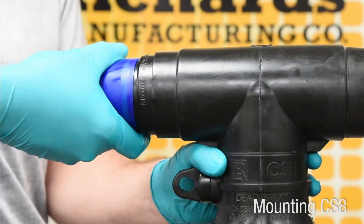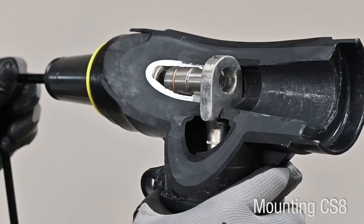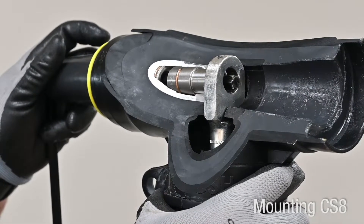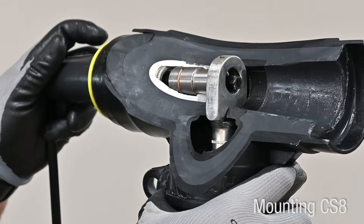The H fastener is through broached, allowing the tool to slide through the fastener and lug hole. Fully insert the supplied hex tool into the CS8 load brake interface, ensuring the tool goes through the hole in the lug. This will help hold the assembly in place until thread engagement is started.